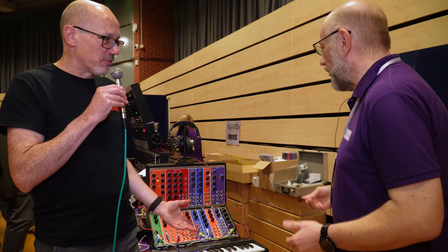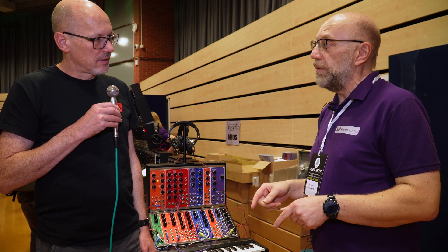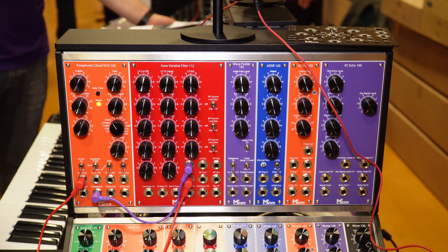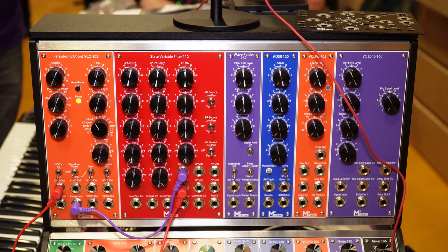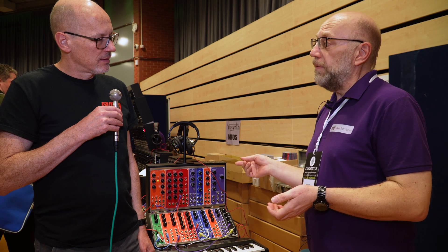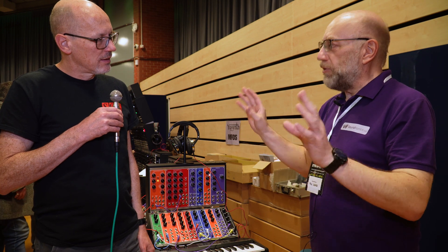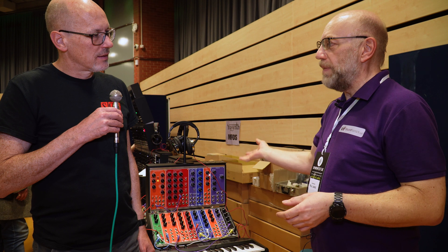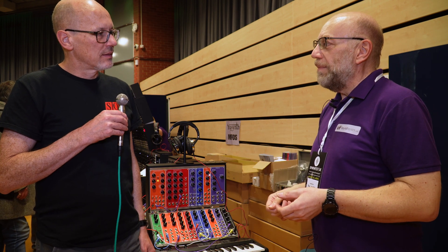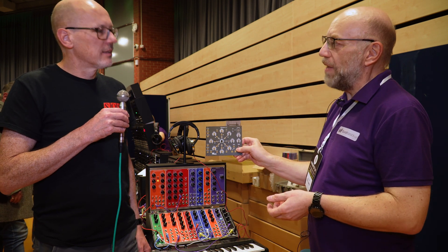It looks like you've got a seriously impressive range of modules on offer as well. We start off with mainly core modules — all the usual VCFs, VCAs, oscillators and so on — plus a couple of extra nice ones. We've got a paraphonic chord VCO with four analog VCOs in it, but they've got a microprocessor to tune them all to make chords. You've got 16 preset chords on there, which gives a nice, beefier, mightier sound. We've also got a digital sequencer — with sequencers you've got your rows of pots, you configure something, it's great, then you need a reset for your next sequence. This one is fully programmable and live-editable as well. But that's not to replace an analog sequencer — it's an addition to one. Hence why we're also doing this version of a traditional eight-step analog sequencer.